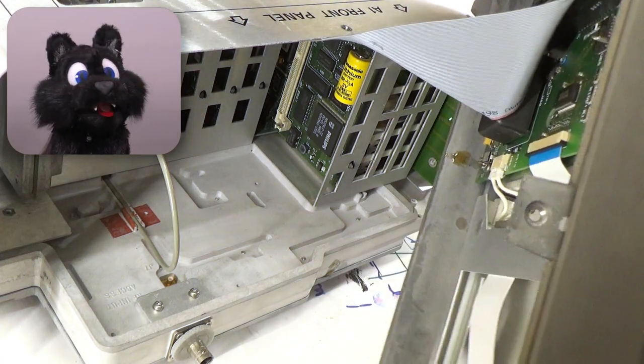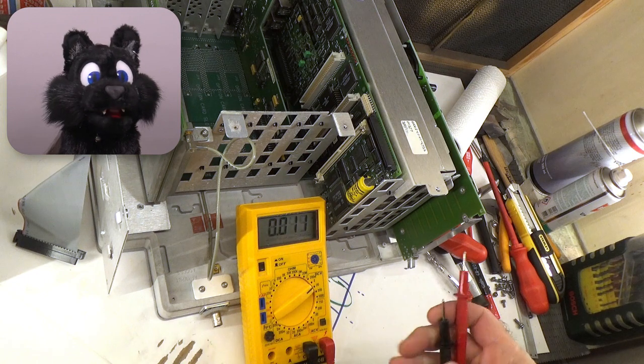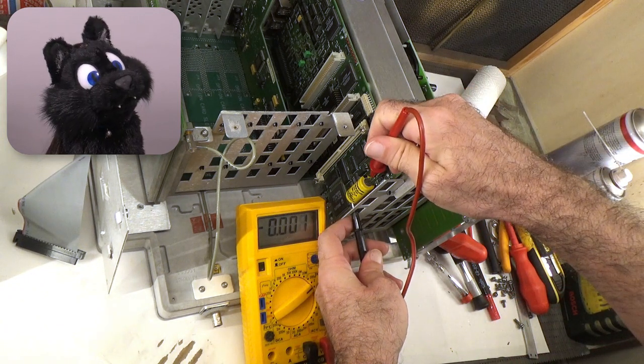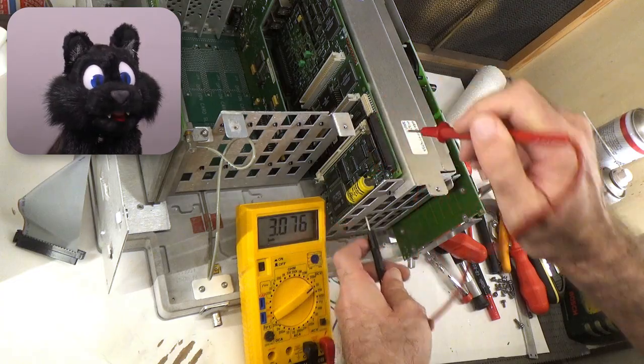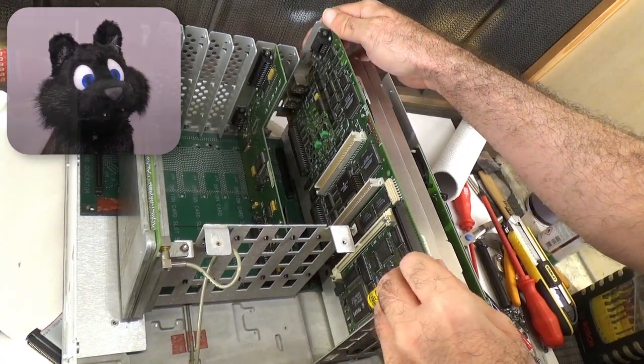Oh, the CPU card has a soldered 3-volt battery. I'm glad to see that it didn't leak, but it sure needs replacing, right? Oh, still at 3 volts? Color me surprised. Still, I better replace it. The pack says it's from 1997.